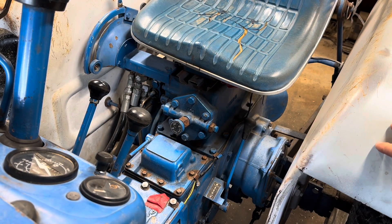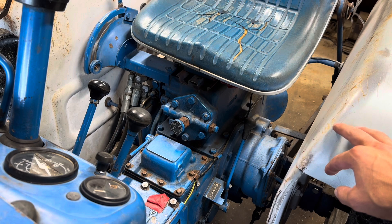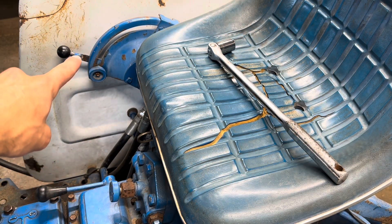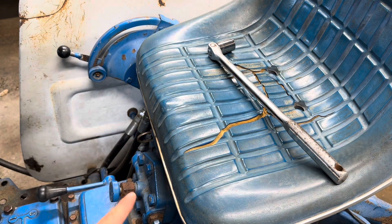Here's the head of the cylinder on the tractor. I think there are going to be two particularly challenging aspects of this project: number one is going to be freeing those bolts, and number two is going to be actually getting that new seal onto the piston. To make sure there's no oil in this cylinder, I have lowered the three-point all the way down. I have my breaker bar ready with a 19-millimeter socket for these bolts, so we'll go ahead and try to free those up.